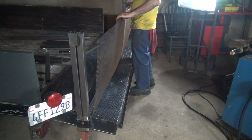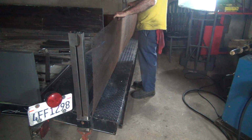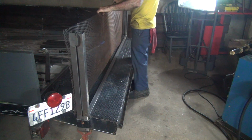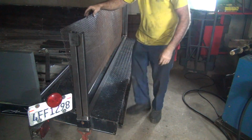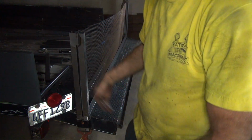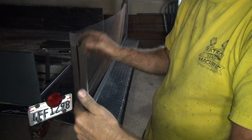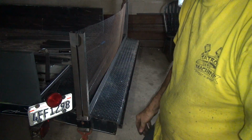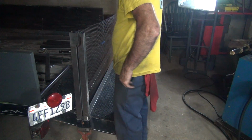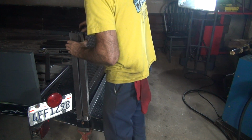The thing is, we don't want to be on the outside. I'll be on the inside. It'll be on the inside because as you push on it, you'll push it against your braces, it'll wrap around the brace. If you put it on the outside, you have to tack it on, and if it hits, it pops the welds and it pops out. So you got to be on the side where the pressure is going to push against it. Otherwise, you have a big problem. We don't need that. So the easiest way is to put it on that side.